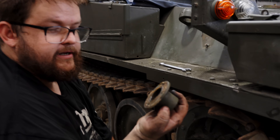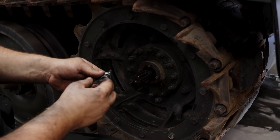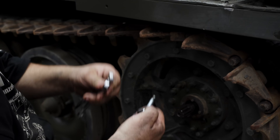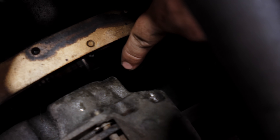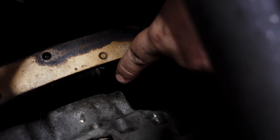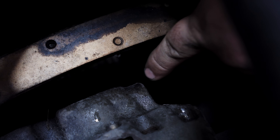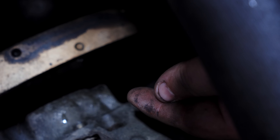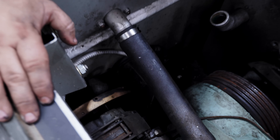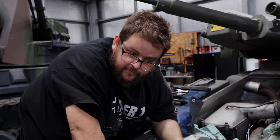There's this little teeny tiny hubcap — it sits over there, four screws and it comes off. There's a thread in the end; I've rigged a random bolt that fit with two spanners so I can have a handle. You can see a sort of detent — or the splines — sticking up between the threads. You push that down and that pops in. And vice versa, when you pull it out, you push it in and someone pulls it out. That's how you're disconnected. You're supposed to do that to both sides before you tow the vehicle.